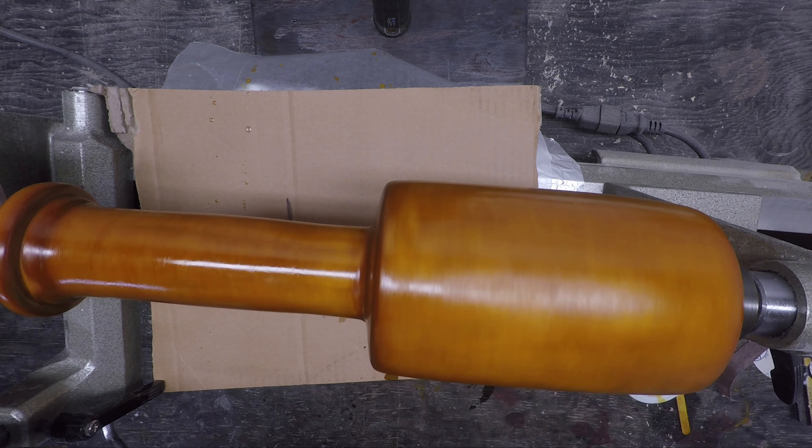Here's another mistake — so now I'm doing 1500 grit. The 400 wasn't bad enough, right? But I take the 1500 grit and I'm going over the top. I was just trying to scratch the surface — I wasn't running it at a high speed, wasn't trying to polish it or anything like that. But you can see on the sandpaper itself that because it was so humid, it just wasn't really working right, and the lower grit sandpapers were just acting so much more aggressive. You can see it did kind of polish out a little bit more than I should, which is probably not good either. And I did let it sit a little bit longer, so the humidity was probably already starting to set onto the surface of the shellac sealer.